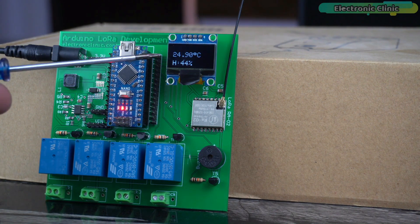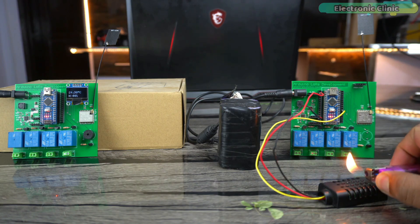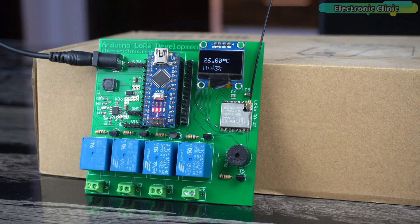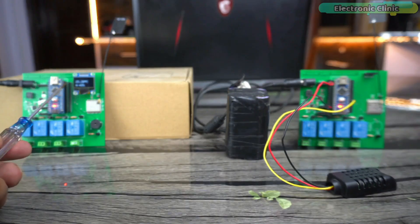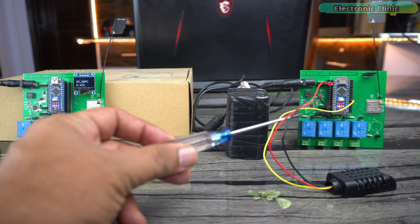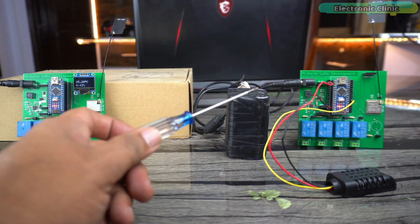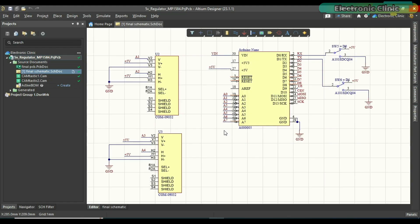You can already see the temperature and humidity values on the receiver side. As I apply heat to the sensor, the temperature values on the OLED display module change — so it's working. During this first test, the receiver side is going to be inside this room and I'm going to ask my brother to take the transmitter outside. I just want to check if the signals are powerful enough to penetrate through walls and different obstacles.